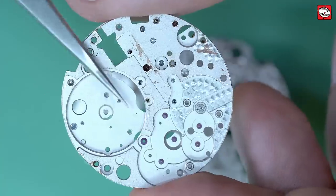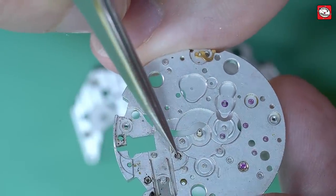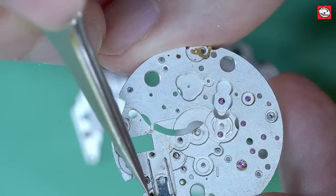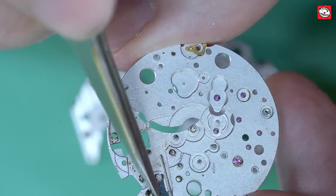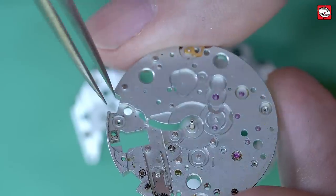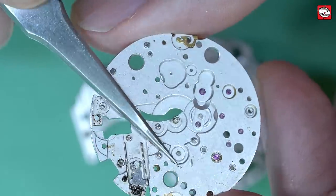And as I suspected, the screws are just way too rusted and are really locked into place. I suppose I could use a stronger acid to dissolve them, but the plating would possibly get damaged, and there are quite a few steel posts embedded in the plate, and these would also get damaged. No, I'm going to have to use the other plate.